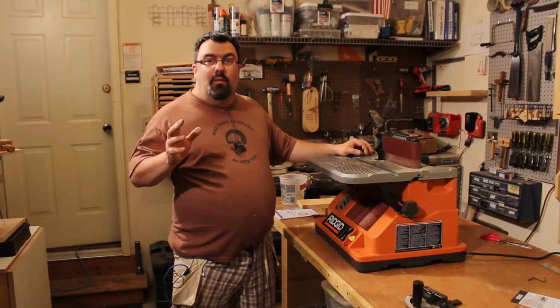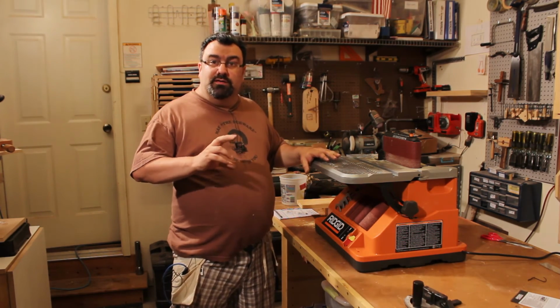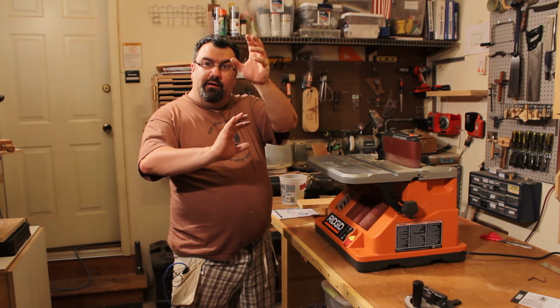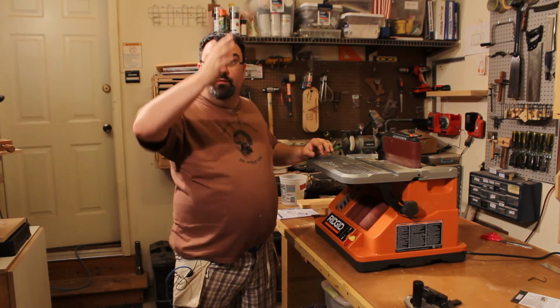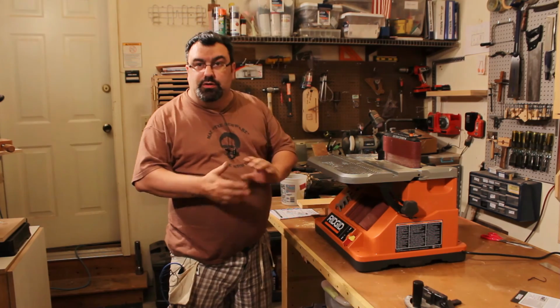One of the things you keep in mind is the way your chuck is in the drill press, it's just a friction fit up there. So if you're putting a lot of sideward pressure, it's not that great on the bearings. And my chuck did come out one time and I damaged my spindle that goes all the way up my drill press, and I had to fix that. But other than that, I mean, it's doable. You can do it, no problem.